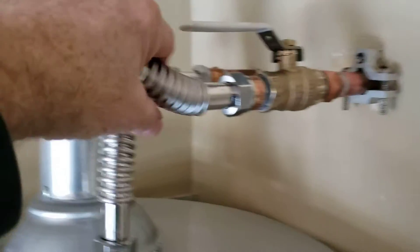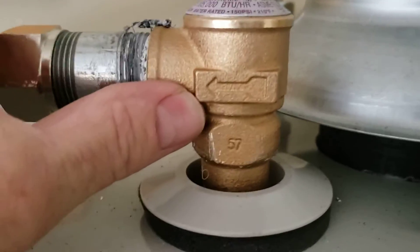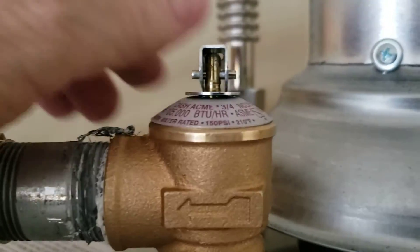The copper was old and corroded, so we gave you new connectors — that way we can warrant the whole installation instead of just replacing the water heater. Brass extensions on both sides, hot and cold, and then a relief valve. This comes with the unit — temperature and/or pressure builds up too much and this thing will pop off and drain to the outside of the building.